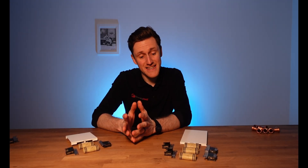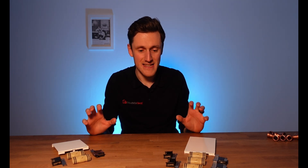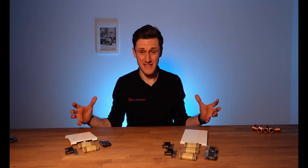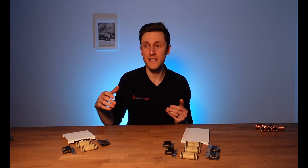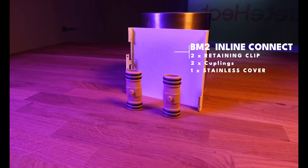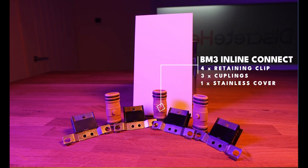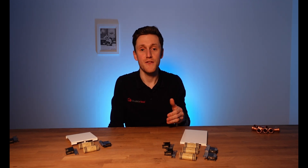Finally, the least-used kit: the oval to oval connection set, or straight coupling kit. It's only ever used when you're joining thermoskirt end to end. Because thermoskirt comes in lengths of up to six metres, it's very rare to have a wall that's completely unbroken for more than six metres — it's normally broken up by a pillar, doorway, or nib. So this kit is only used in extreme circumstances with a massive unbroken run. For the BM2 the kit includes two stainless steel retaining clips, two couplings, and a cover plate; for the BM3 you get three couplings, four retaining clips, and a cover plate.